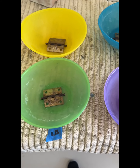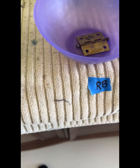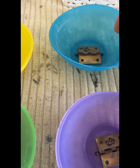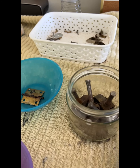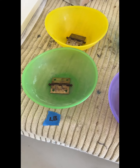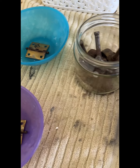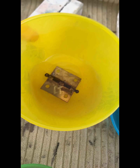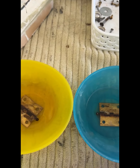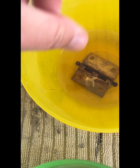I'm going to add some lacquer thinner to my hinges. I labeled my hinges but the lacquer thinner will take the labels off, so I just label it down here so I know — right bottom, right top. Then I put all the casters in a glass jar and let it sit for a while. This has only been sitting maybe 30 seconds and you can already see a lot of the stuff starting to come off.